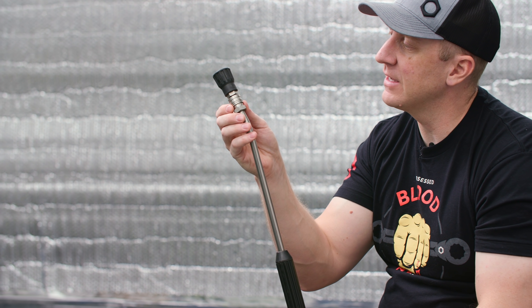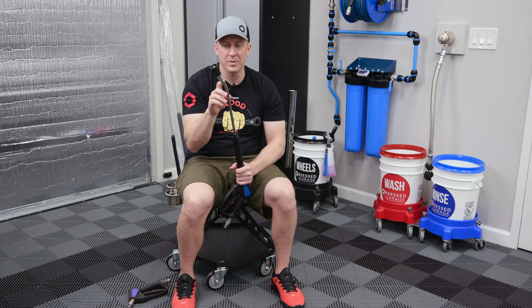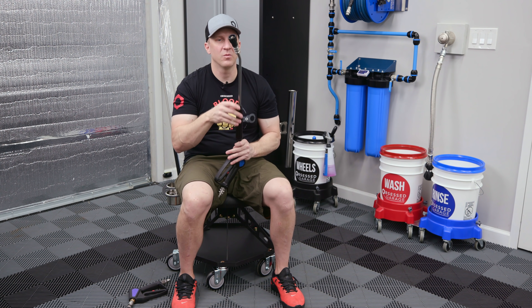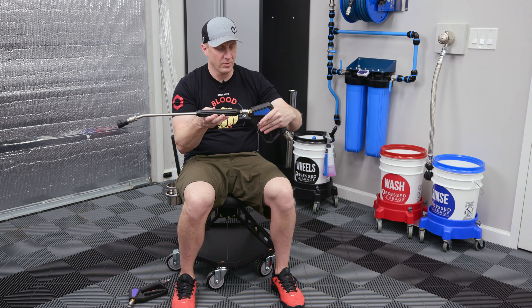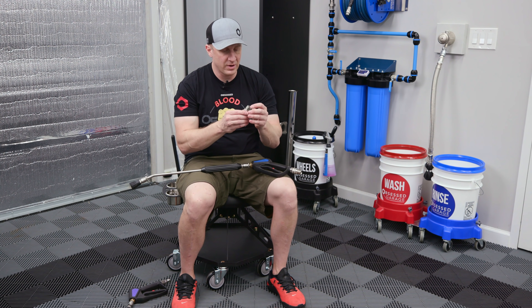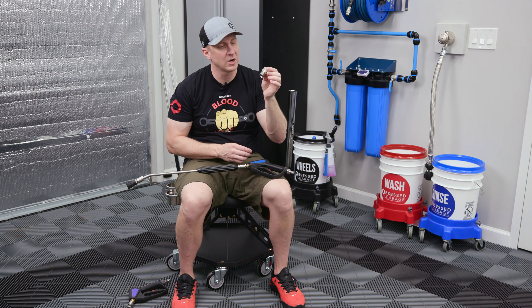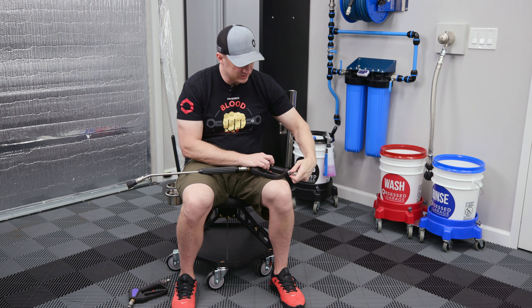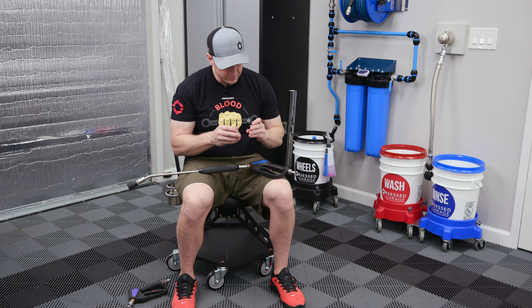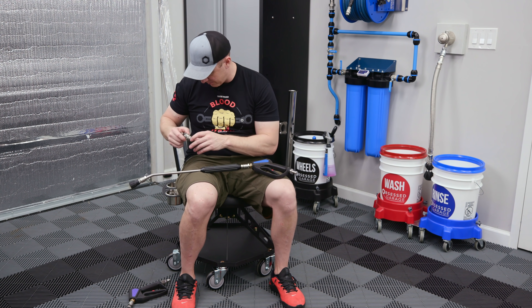We also had to make a specific fitting for the wand - a female G-type or G-thread fitting. We actually removed these from being sold individually in the store because it really only goes on the end of a wand since it's a G-thread, which is an equal-length thread, so you won't see any threads protruding on the end. Keep in mind that the o-rings are another maintenance point - if you ever have stuff spraying out the side of your gun you may have lost your o-ring. It's very rare that o-rings pop out of these, but it can happen.